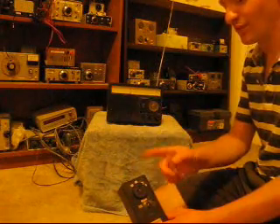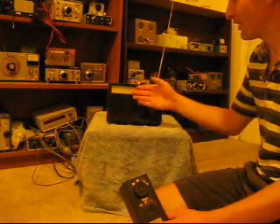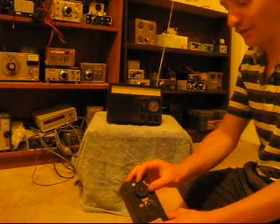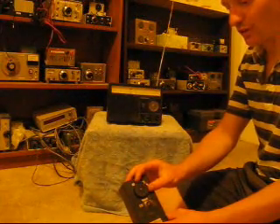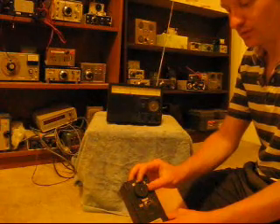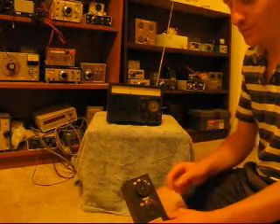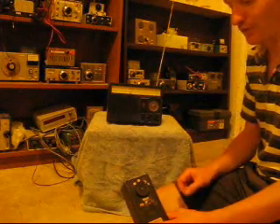The other great thing about having the BFO at the signal frequency rather than 455kHz is tuning these receivers. They often don't have a fine tuning control, and even then it can be quite hard, plus they drift. In this case, the sensitive tuning is done on the BFO, not the receiver, so it's a whole lot easier to do your tuning. The BFO covers around 100kHz on 80m and 200kHz on 40m — therefore, 200kHz of coverage versus a few millimetres on the dial, so it's much, much easier to tune.